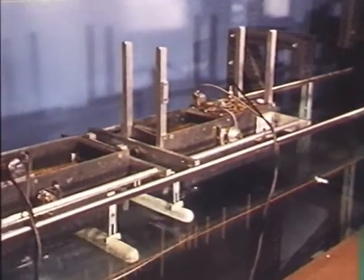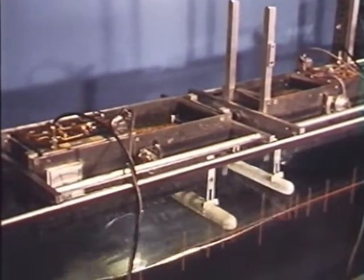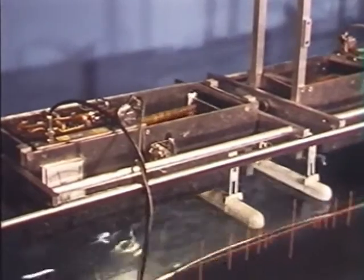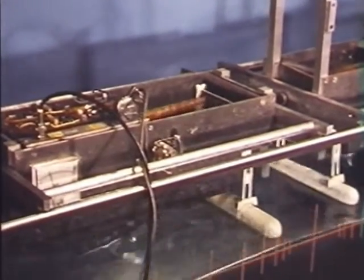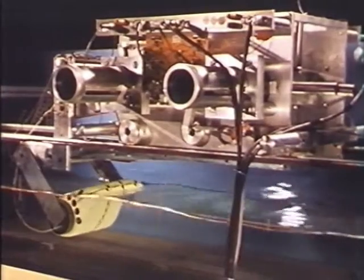Here's a closer view of the two floats. They measure the waves right across the width of the tank. They work by having a micro-ammeter movement coupled to a heaving float through a straight line motion. And we amplify the velocity signal and integrate it.